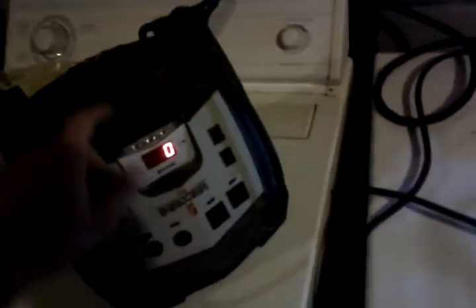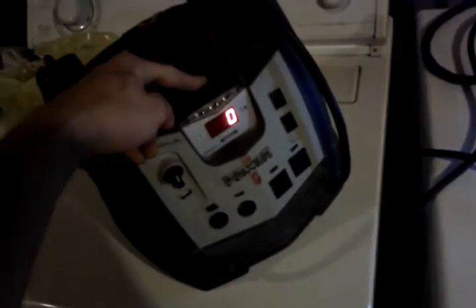So we're going to try this little inverter I built. It's just a tiny little thing with 18 amp hours worth of lithium ion batteries. I'm going to plug that in. It seems to be running it happily - lights came on. Let's do a quick test. The rest of the lights come on in the basement - that is awesome. This is only a 200 watt inverter and all the lights are running. It's much better. Obviously the inverter built into the booster pack is not great quality.